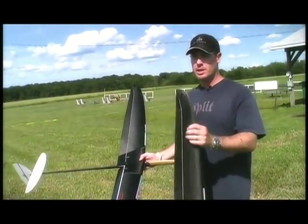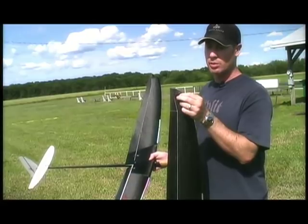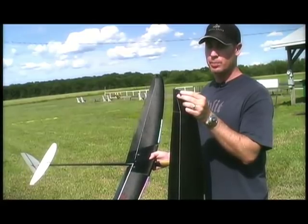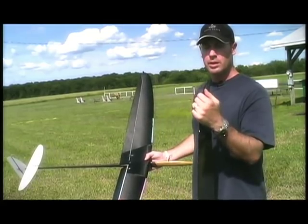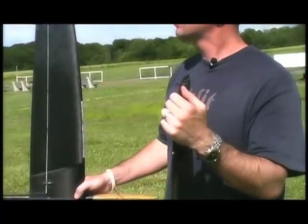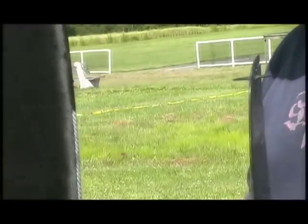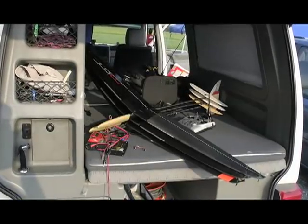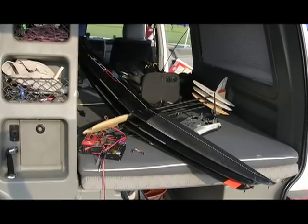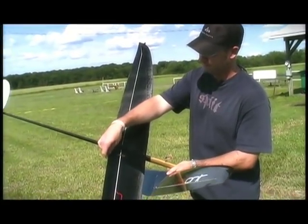The peg construction takes a little more care than Kevlar because the skin and wing is so thin with no blue foam substrate. You have to mount your peg with a couple of doublers, otherwise you'll probably pull it out. This plane is in the U.S. — leading edge technology as it is in Europe. Again, built by Rock Borden, and this is the Salonit.